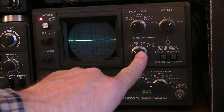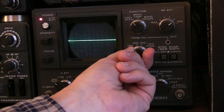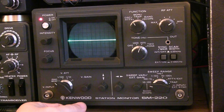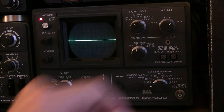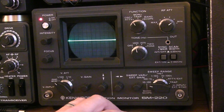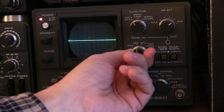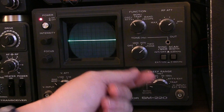Finally, the scope also includes a two-tone signal generator, with output on this one-eighth inch phono jack. It can output a low-level one kilohertz tone as well as a low-level 1.575 kilohertz tone, or both simultaneously. They're pretty low level — designed to be around microphone level, about five millivolts or so. They could be used as test audio sources when you're working on a transmitter to get things adjusted, maybe in an audio preamp. The two-tone test can also be useful to look at linearity of both the audio chain and a power amplifier chain.